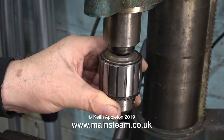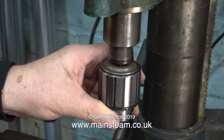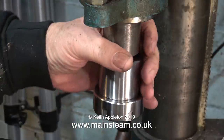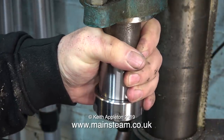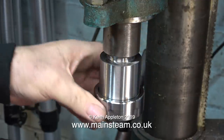As you can see, by tapping the top of the drawbar the R8 taper is released, and it's only at this point that you need to unscrew the drawbar fully to remove the tooling. This is an ER40 collet chuck, and it's also on an R8 taper. I've re-engaged the drawbar and I'm tightening it up to hold the taper firmly into the spindle.